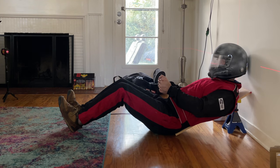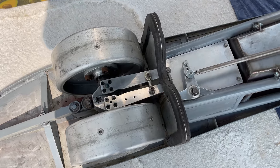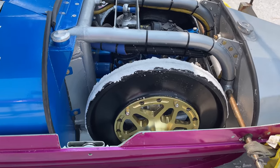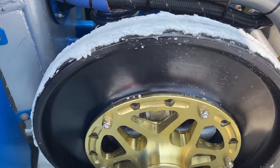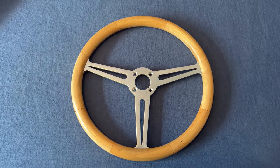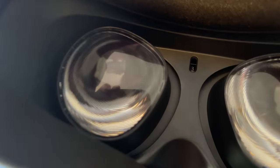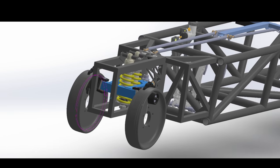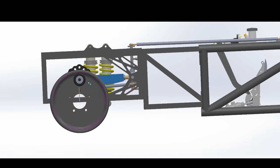There's nothing more accurate than lasers. My car is very short — just over two feet tall. There are people who have cars on the salt that are shorter than mine, but they're all running solid aluminum front wheels so they can see over them. I can't strap an Oculus to my head and lie down flat with cameras pointing out the front of the nose, sadly. I have to be able to see over the front wheels. I did some design around the different scans of me to find out how much bigger my car is with rubber land speed tires versus smaller solid aluminum wheels. There is a difference, but it's not very much. The minimum width is my shoulder width plus the crash structure, and since I need actual tires in the rear, my minimum height is dictated by those.